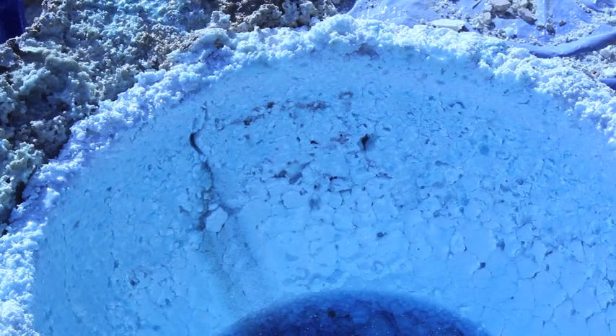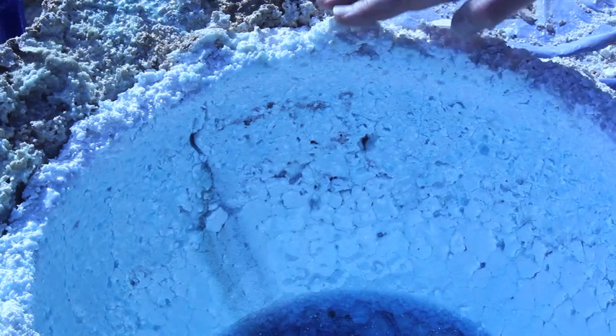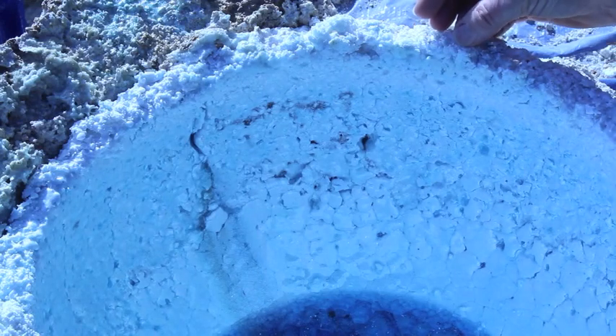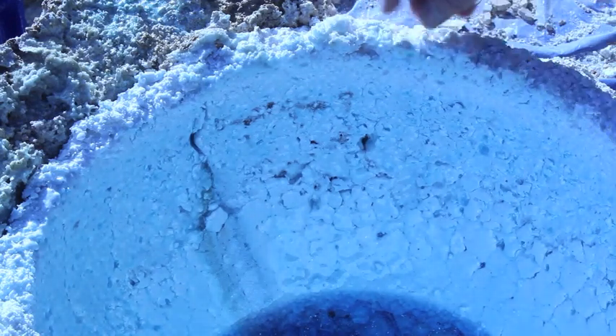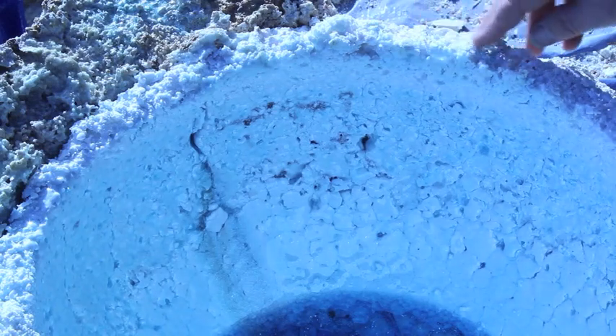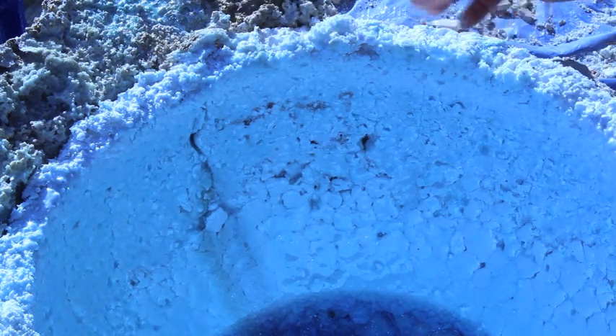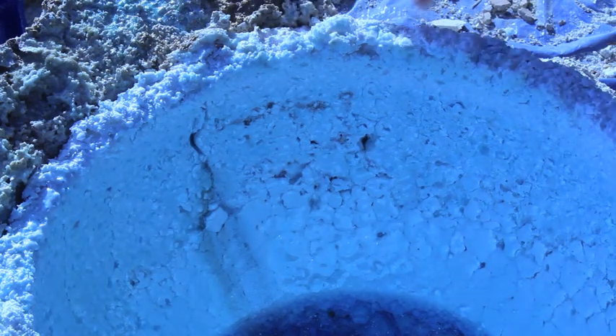I wanted to have a look at the crucible before I smashed it up and took it to the landfill. It's amazing how glass will sit on a flat surface and just boil - it froths up like popcorn or styrofoam. There are two real decent holes where the glass was flowing out into the space between the crucible and the investment casting. I'm really glad that I do an invested pot; there's no way I could have gotten decent crucible life out of this with a free-standing pot.